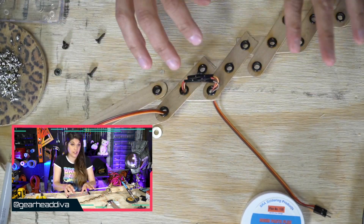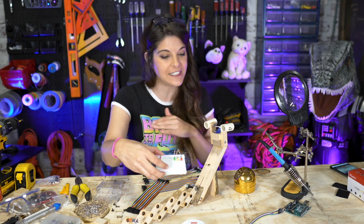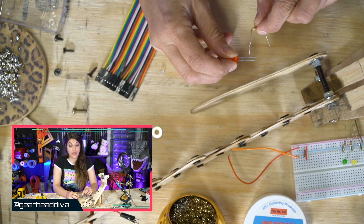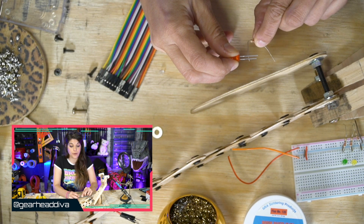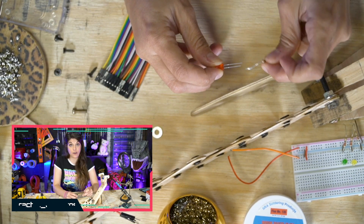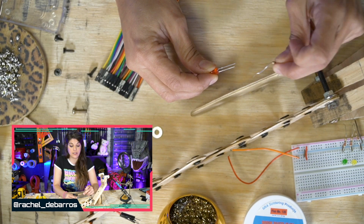His tail is going to be kind of puffy, so it will hide some of these imperfections. For our breadboard we only have one of each color, so we've got a cyclops — that's just not going to do; we're going to do two of each color. The longer lead on an LED is always your anode, so power hooks up to that. The shorter lead is your cathode, and that goes to ground. Your resistor can go on either side — it really doesn't matter. For prototyping I tend to put it on the anode because it means less wires on the breadboard; for actual wiring I tend to put it on the cathode. Either works, but it's important to keep it consistent.